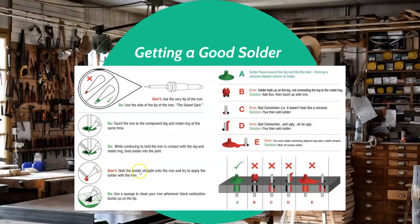Don't try to put a whole bunch of solder onto your tip and then transfer it — it's not like using glue and it's not going to work. You'll end up with a mess and won't have a good connection. Use a brass or wet sponge to clean your tip often, because as you use your soldering iron, particles in the air oxidize onto that hot tip, forming a film that makes it dirty and impedes heat transfer. Just make it a habit.